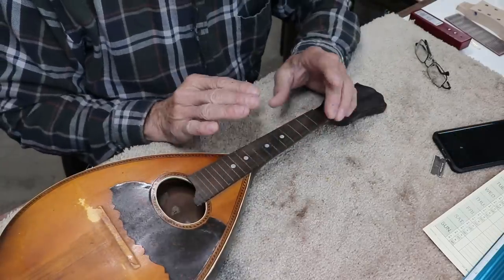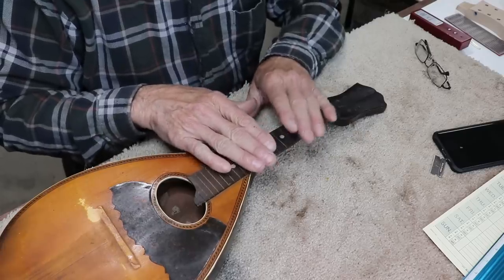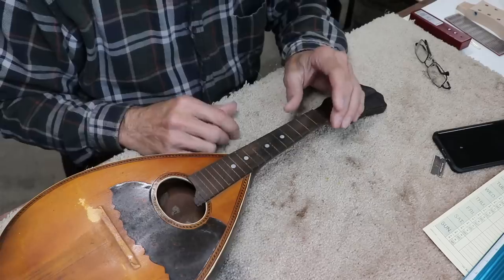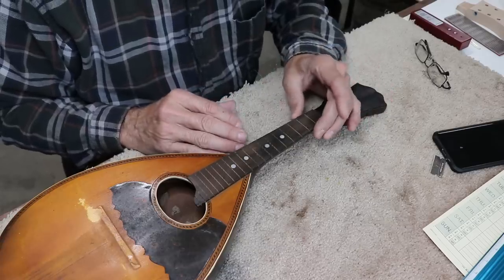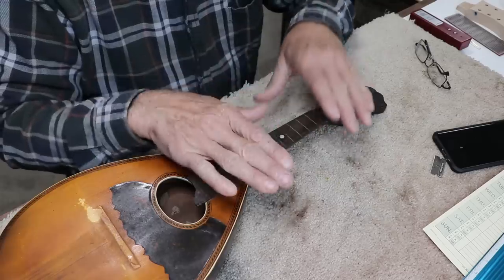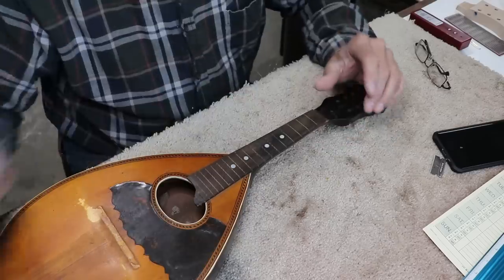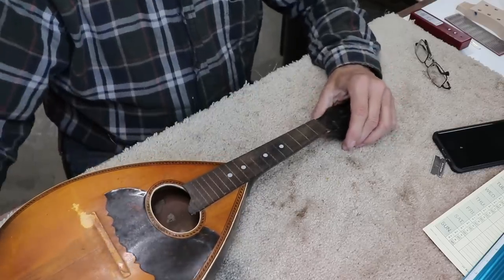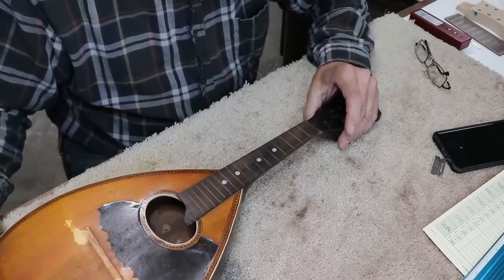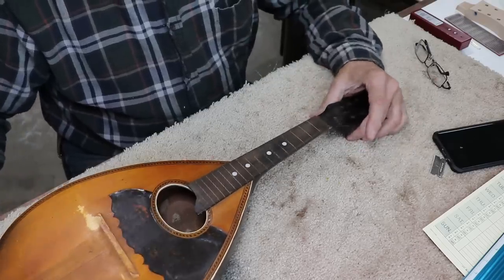And the thing is, it may actually overbow a little bit when I put the new frets in, because the new fret tangs will probably be a little bit larger, and that will create a slight overbow. We may be okay with that. That happens. It for sure happens on a regular fretboard when you've got it laying loose, and I kind of think it's going to happen on this. So I think I may just stop there and get the rest of it out in the frets themselves. I'm pretty sure I can if I have to. I'm just going on intuition and experience.